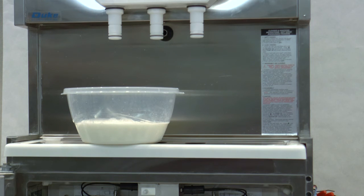One common error that comes up with this is the pump timeout of 3.5 minutes. Depending on the operator or how they're accustomed to doing this, they may hit that time period. When you're in clean mode, the pump will just switch itself off. It will not throw an error or shut anything off. Okay? You just turn the pump back on and keep going.